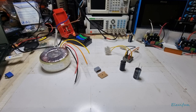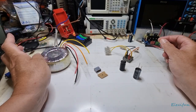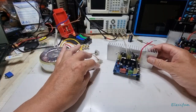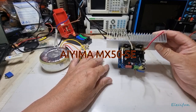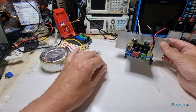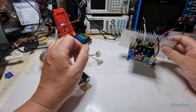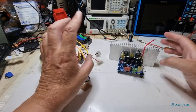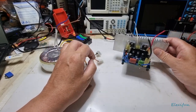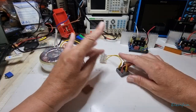Hello everybody and welcome back to my vlog. Today is going to be a quick look at a basic unregulated power supply for our MX50. We looked at this last week and we could see that if we run at 25 volts it would be alright for the quiescent current, but if we went up to 31 volts it started climbing — it was going to turn class A and possibly break. At 25 volts we seem to be okay.